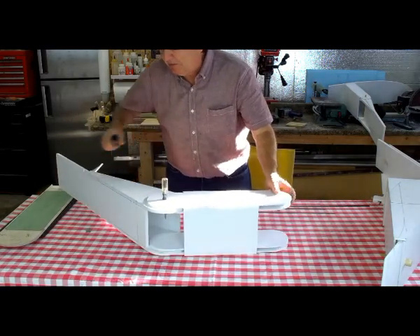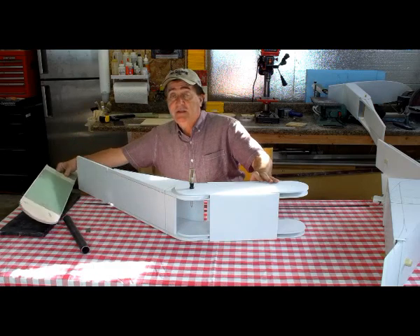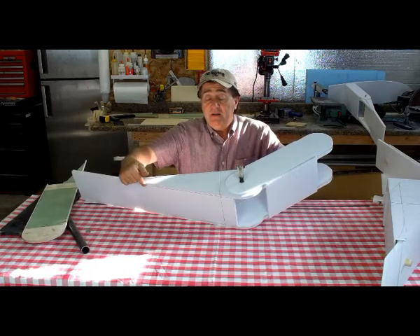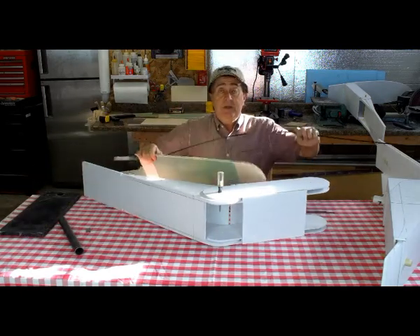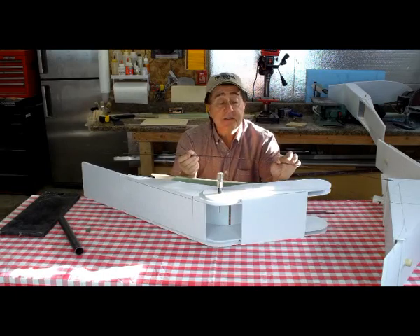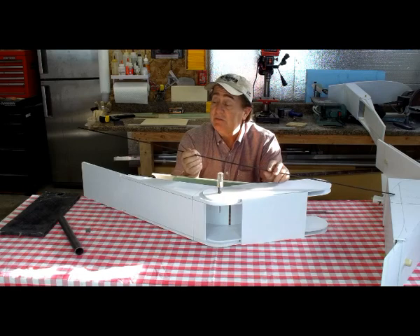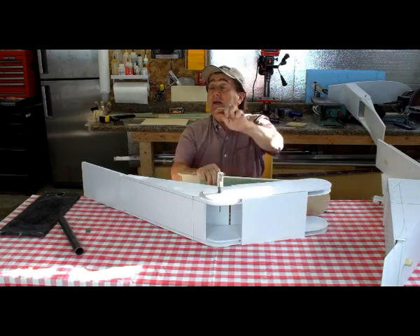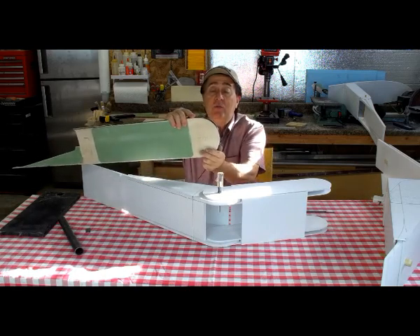This portion here would be the shear web that goes out along the wing — the back side of the D-tube. I thought: if I just add this shape on top like this, I can carry the loads right around like that. The original plan for the cap strips was to use these pultruded carbon fiber strips — I had this made in China, bought a big spool. In the US you can only get these in eight-foot lengths, but I contacted a factory in the Hong Kong area, asked them not to cut it, and had them spit out 140 meters on a spool. Two weeks later I had it.